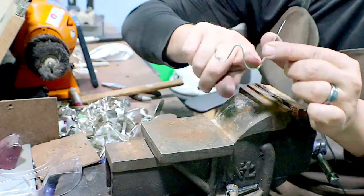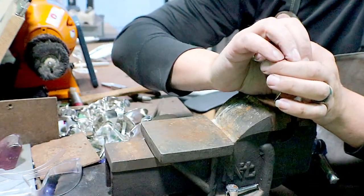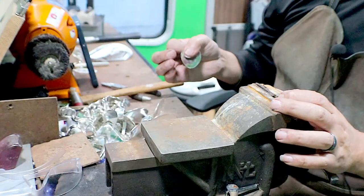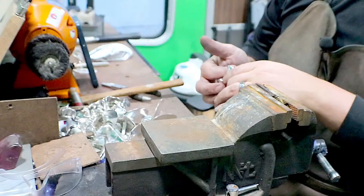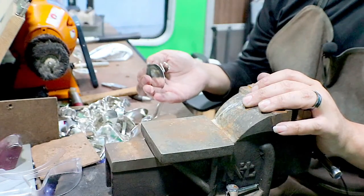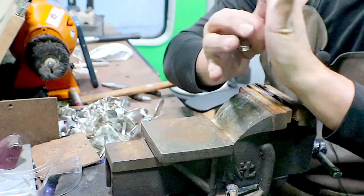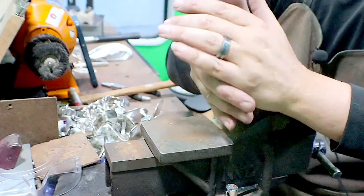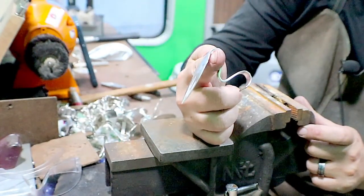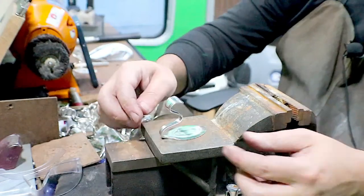Again, I'm putting my finger right here, putting the handle in my palm. So I thought about making a jig for it, but the press is about the fastest I could bend it. Because each spoon is different, it ends up changing all the time. So I'm here, and I'm just gonna put the bowl in the palm of my hand, and I'm just gonna squeeze them together. Let's see, keep it that way. So it's pinching my finger now. And we've got our middle piece here over towards the middle. Check for flat. So we are flat and we are straight.